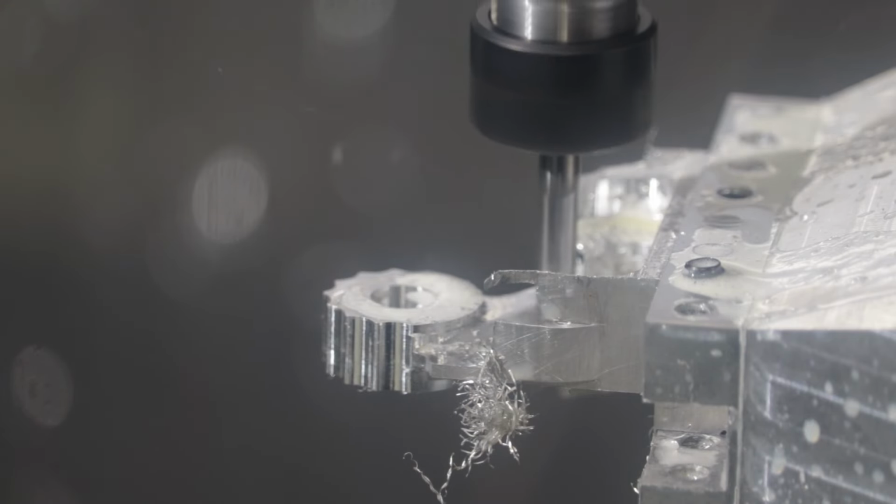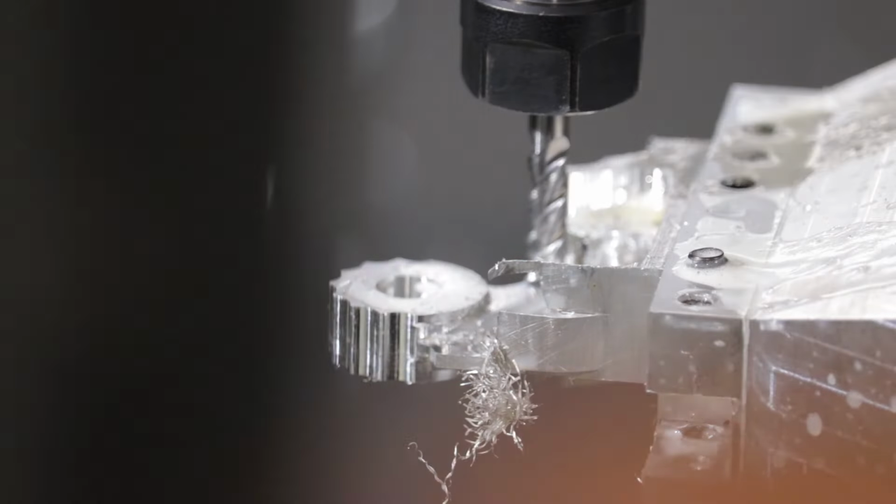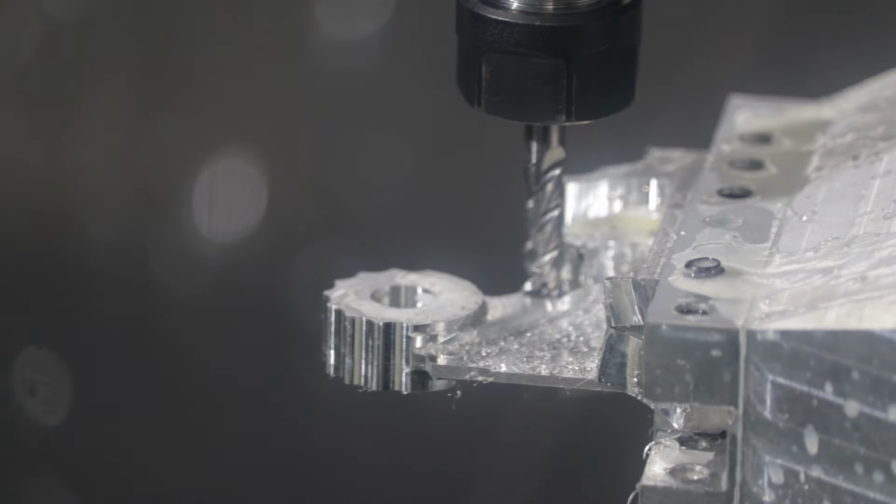Of course, that sheet metal's in the way. Let me pause. So I hit feed hold and spindle stop. Now I can open the door, and let's give you a better view. Actually, I'll clean up the window a little bit too. Now I can close the door, because this mill's got door interlocks, which I recommend using with 5-axis mills. Don't try to defeat them. And then if I hit cycle start, it'll turn the spindle on and continue machining.